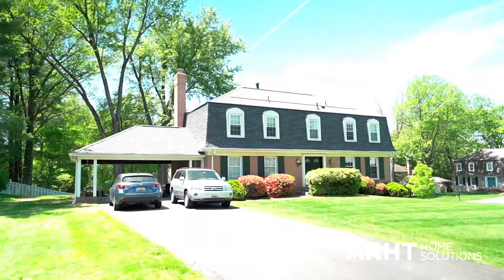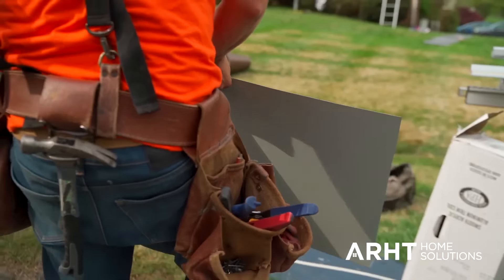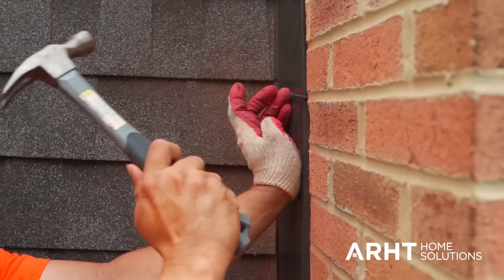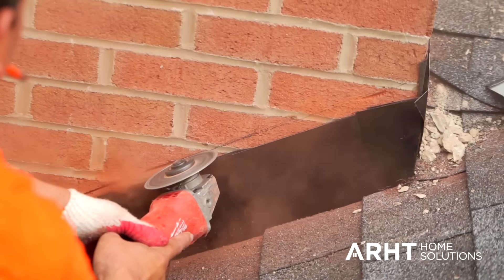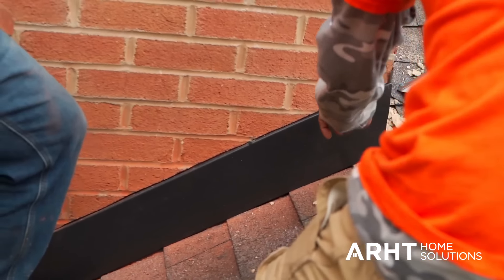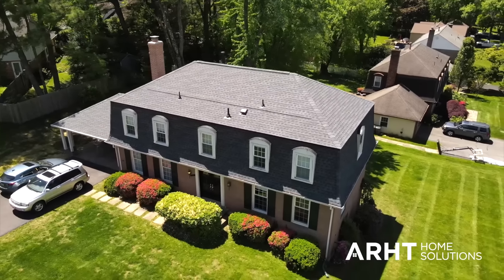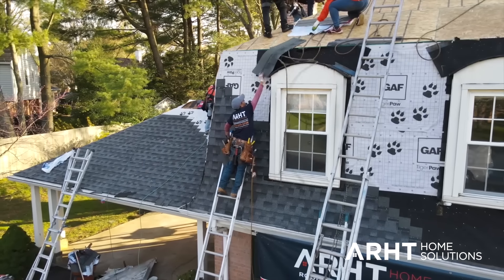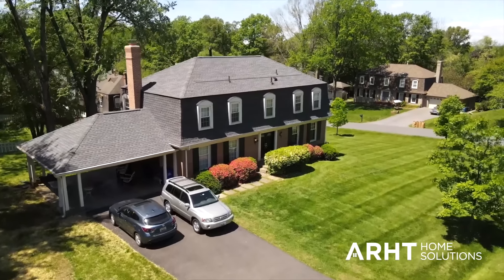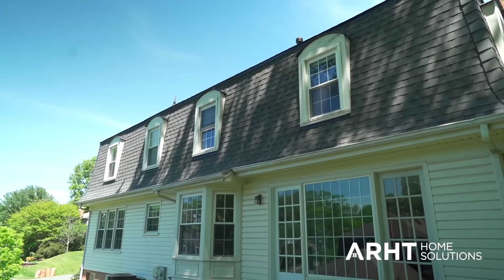Typically constructed at the rear of your property, it features a horizontal roof and nearly vertical back wall, creating significant space. Windows are often integrated within box-shaped dormers, extending internal space and allowing natural light to enter. This design seamlessly blends with your home's appearance. There are variations of mansard conversions: L-shaped mansard adds extra space by extending over the back of the house, often above the kitchen. Double mansard is the largest option, involving both front and rear extensions, resembling an additional story.